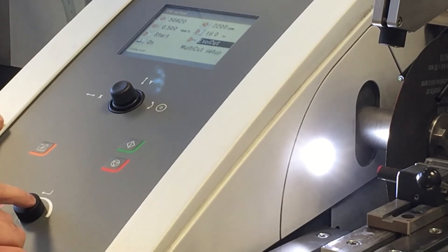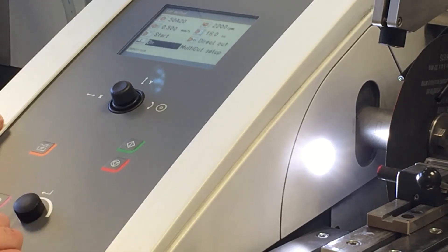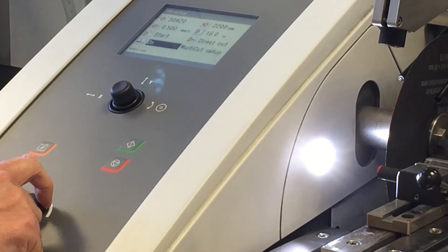Now the cutting mode. Today we're going to use direct cut, but it also has an exit cut function on this machine, should you be putting anything large or high in hardness that requires a bit more coolant between the wheel and the sample. Because we're using the X-Table we're going to use the multi-cut option to make sure that the cut we take is exactly 10 millimeters.